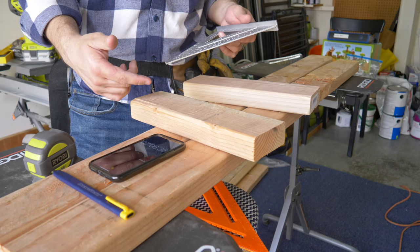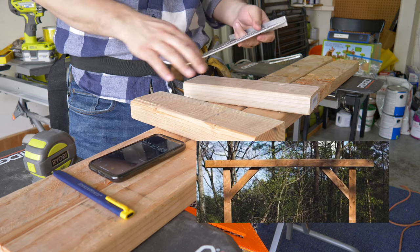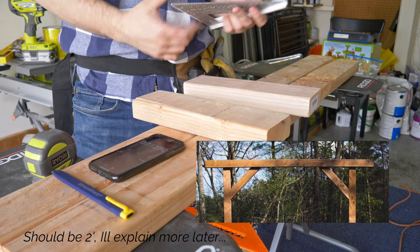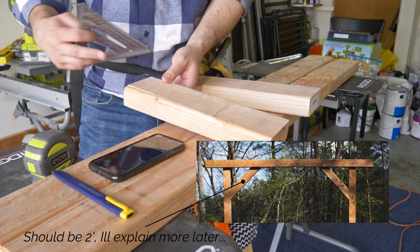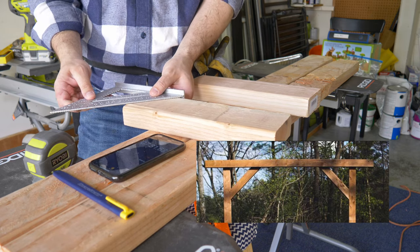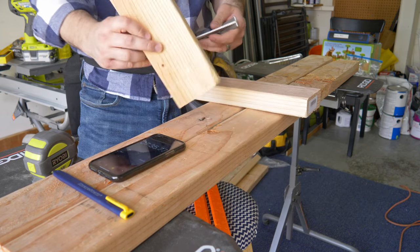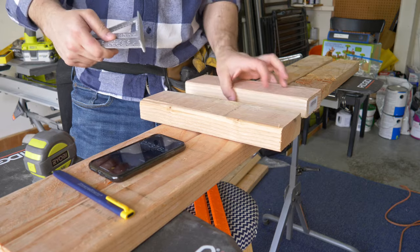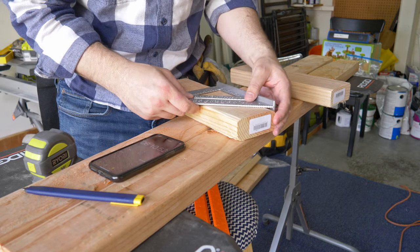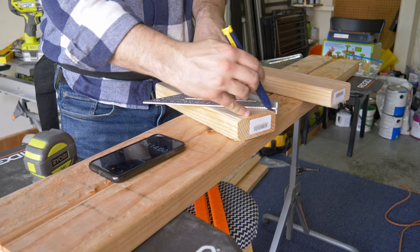If you look at the top corners of the arch, you can see that there are two pieces holding it together. I'm gonna measure out from the corner of this to wherever it ends on the 45, and cut that right there, and these will go in the corners of the arch for support. So I just found the corners and lined up the 45.